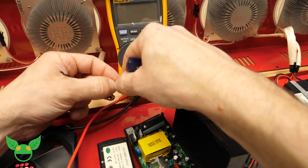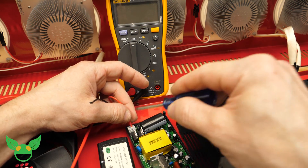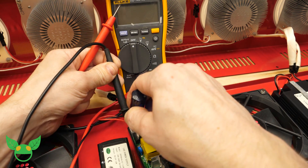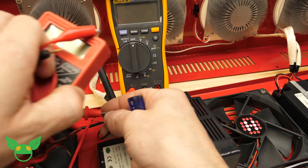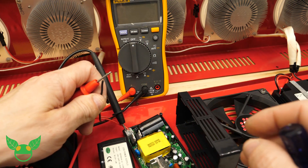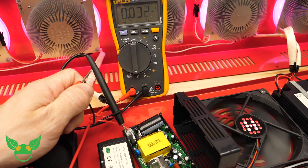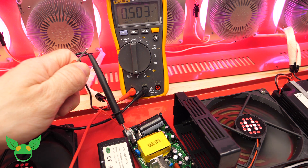Amps is a little more complicated because you can't just simply touch the wires to what you're trying to test — you actually have to run current through the multimeter. Most multimeters have about a 10-amp ability. I'm going to plug the positive back into the port from which it came and plug the negative into the negative of the driver. I'll put my multimeter onto amps with the little dotted line, which denotes DC. The swirly one — the sine wave — denotes AC power. We'll go ahead and check the current. And how about that — 500 milliamps on the nose, or half of an amp.